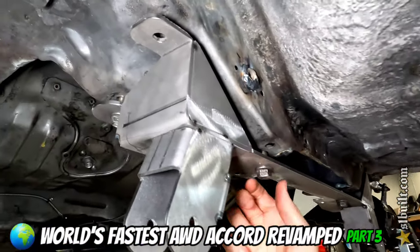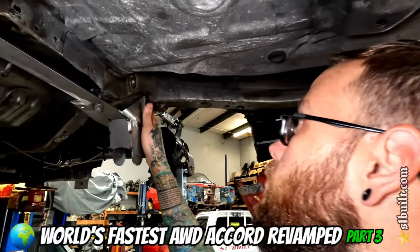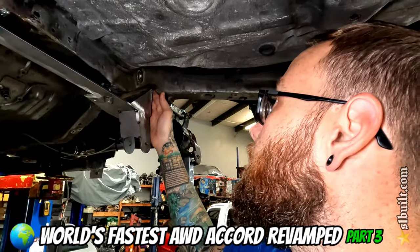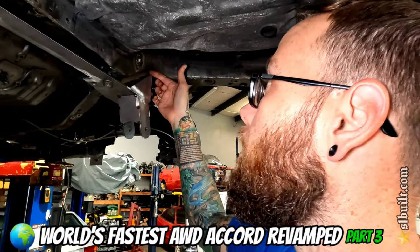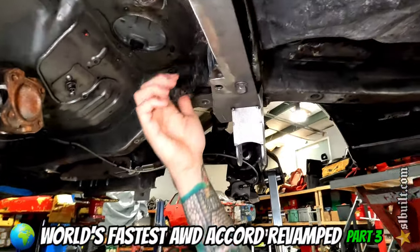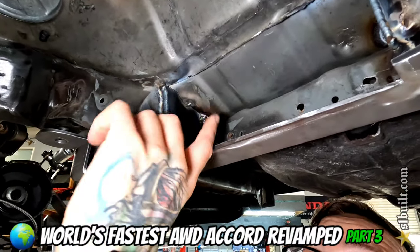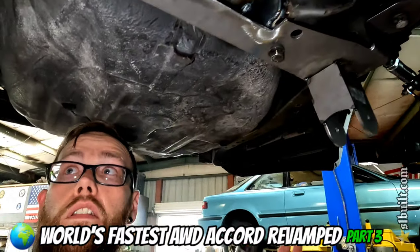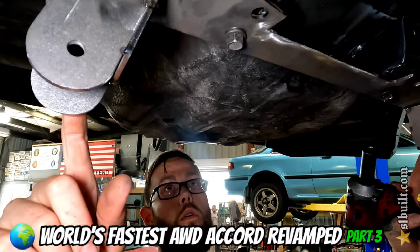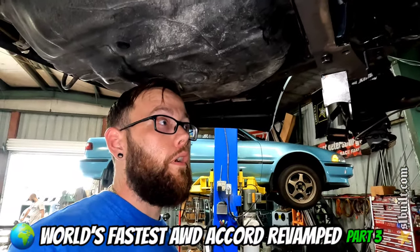So as you can see here, we're putting the bottom base of the diff mount plate up. I had to do a few different things to modify the one that's going to be for our core kit. On his chassis it has a nub there where one of the points would come out and bolt in to a 10 millimeter. On his chassis it doesn't have that one, so I went ahead and cut that ear off — we're going to reinforce it, weld it up here and just brace everything from that side. We just got done completing welding these plates here, which just box off the back of the subframe. I'm going to go back through and add seam sealer into the tops of those and then the back just to make sure everything's good. Next we're going to work on getting the bar notched just enough so that it's centered with these two holes, then build the top bar from that and work on the diff mount to make sure the position is correct for its driveshaft length.